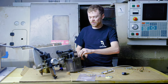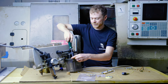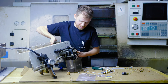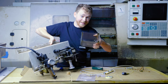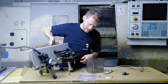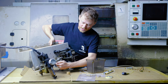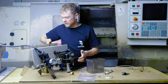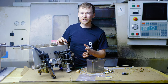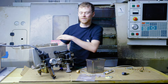To start with, we're going to do maintenance on the front here, and we'll pop off this Waylube tank. This one is pretty clean. Usually there's that much muck and even chips get inside here. Now we can see the bottom is where the suction filter is, and over here is where the inline filter is. I'm going to lay it on its back so that we can all see, but when you're working on your machine, you almost have to lay on your back and look up underneath here to get the filters out.